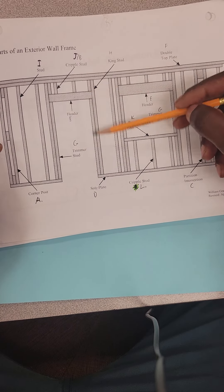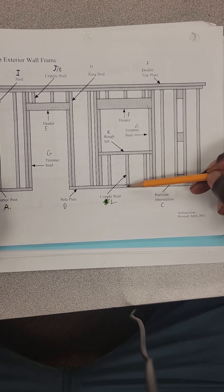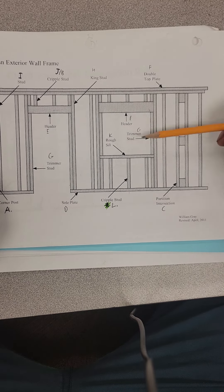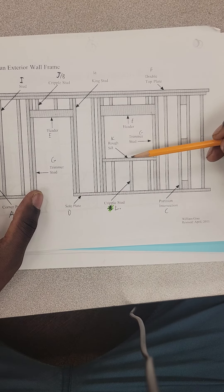A rough opening is formed by the framing members. Your rough opening runs end to end — you might get a layout where the window opening is four feet, so from center you go two feet each way. You have to be careful with rough openings because once you start framing in it's going to shrink up. I always say use a quarter inch more on both sides, giving you a half-inch of total play — a quarter inch each direction — so you can get your drywall or trim pieces in there. You don't want it too tight; a rough opening gives you room because the trim person will come in and handle all of that.